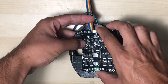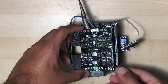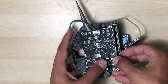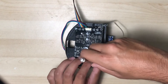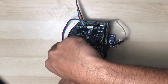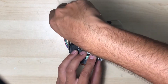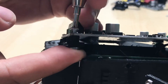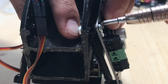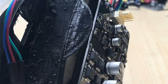That'll give us plenty of room to actually mount the motor driver on top of them. The motor driver should be oriented something like this — just double-check that those holes line up with the pre-tapped holes on the internal cradle. Now use a screwdriver to thread a 4-40 machine screw through the bottom two and top left pre-tapped holes. Then thread a 4-40 nut onto each screw from inside the internal cradle. This will keep the motor driver snugly in place.